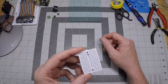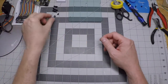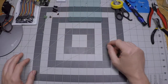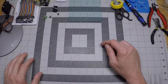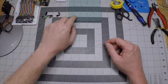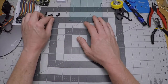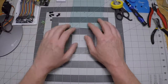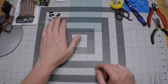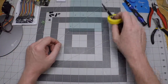We've got our little miniature 170 point breadboard, a 2-pin 5 millimeter terminal block, and this little PCB mount button — this is the 6 millimeter type. You may have a 12 millimeter type which will involve slightly different installation but no big deal. I have some nylon standoffs to attach my Arduino to the three screw holes in the sled. If you don't have standoffs you can use double-sided sticky tape or hot glue — standoffs are the best solution but other methods work fine.